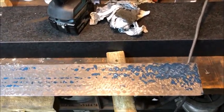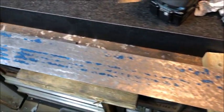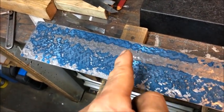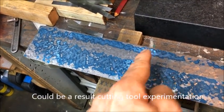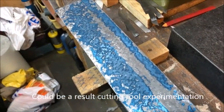So now I've just added more blue, a little bit excess blue, just to emphasize where it hits. As you can see I have an area in between here which needs to go and blend in here, so I have to take this down, but it's not much really in height, but enough.